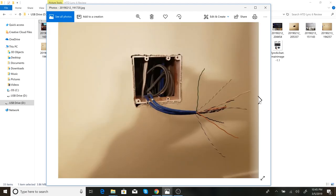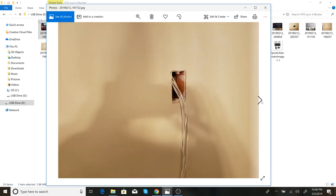As I mentioned, I was able to pre-wire my house — both electrical and low voltage. I knew where I was going to run my keypads, so I ran CAT6 to each of those locations, and I also ran speaker wire through those locations. Just in case I ever wanted to add another volume controller or change something, I looped a little extra speaker wire at each location for future-proofing.